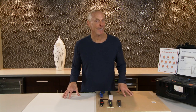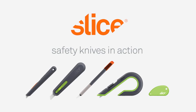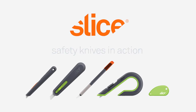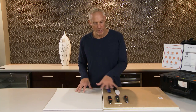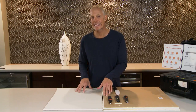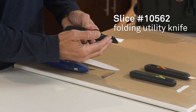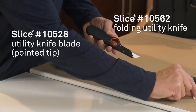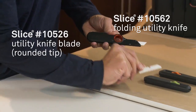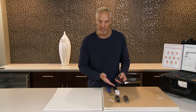In this video, I'm going to show you how to safely score drywall using sliced safety blades. We've had a lot of requests about scoring drywall with sliced safety blades, so I'm going to quickly demonstrate that using one of our new tools — the slice folding knife with a pointed tip 10528 blade. You could also use the rounded tip 10526 blade. It's a much safer alternative than using traditional blades that are very dangerous.